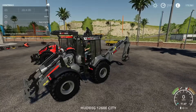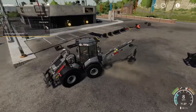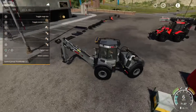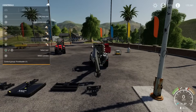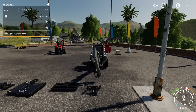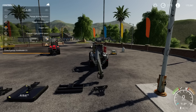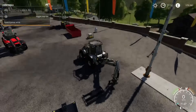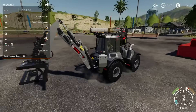Now we move on to the backhoe stuff. Switching to the Huddig City. Backhoe attachment — I've got a bit of tilt on that. NMC adapter: what happens with this — I go to backhoe, raise my arm up. That is an adapter taking it from the backhoe to a wheel loader implement, so with all the wheel loader implements, we've got much bigger buckets and all sorts of stuff to hook up. Which means you could hook up a wheel loader implement to the backhoe — if you're moving stuff and want to use the backhoe with a larger bucket than the dedicated backhoe options offer.